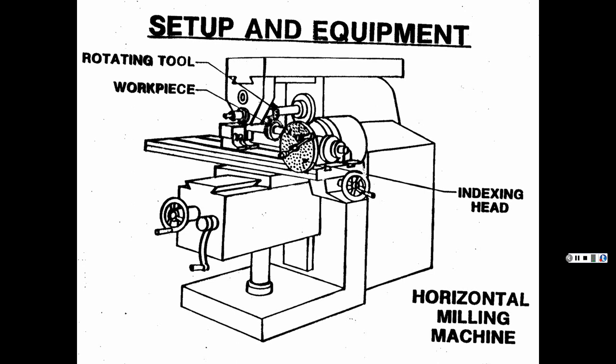And then if you go to engage, let's say, a machine part, or engage some gearing in your gearbox for your car, yeah, it's going to make a heck of a noise because you've only got half of a space for a tooth there. It's going to break off that other tooth, then you're going to have some slop there. And that's not good. So that's what that does. It takes longer because you have to cut one tooth, rotate it once, cut the next tooth, rotate it once. Well, you can see. But if you're just making odds and ends specialty parts, you're not making any batches, you just custom make everything for people, you're just a little machine shop or whatever, then this is fine.